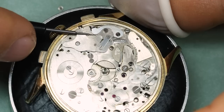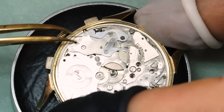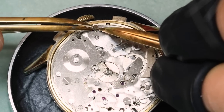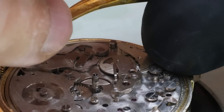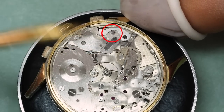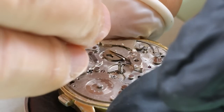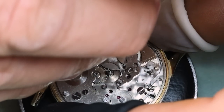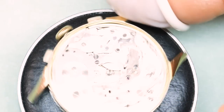What we can see here is that we cannot really reset. The reason is what I mentioned — we need to slightly adjust the way the hour counter wheel is held down. There is also on this hour hammer an eccentric that adjusts the depthing of the hammer action to the pusher. By adjusting it, we can make the engagement of the hour hammer to the hour wheel a little bit deeper or shallower — in this case, deeper. That looks better.